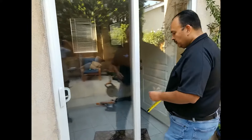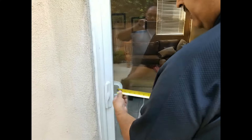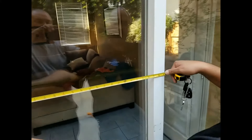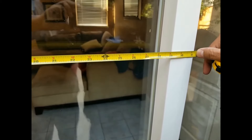The first thing you want to do is see if you can measure from the inside — my large tape measure won't really slide in there. So on my width, I'm going to use my window screen tape measure, which is this little one. You basically take it and put it on the inside of the frame, right to the edge of the glass where it meets the frame. It's 31 and a quarter, so I'm going to go 31 and a quarter.